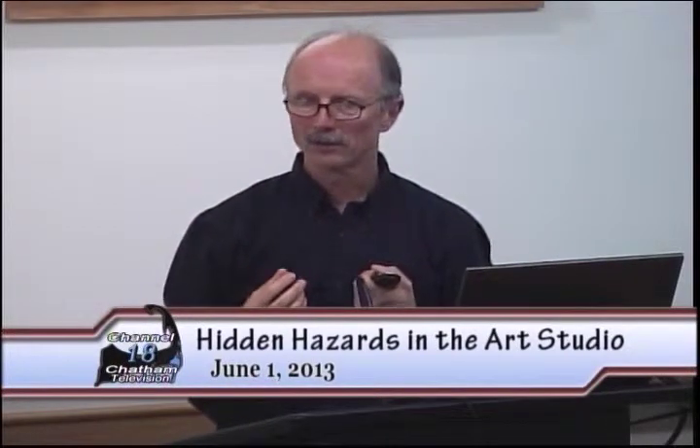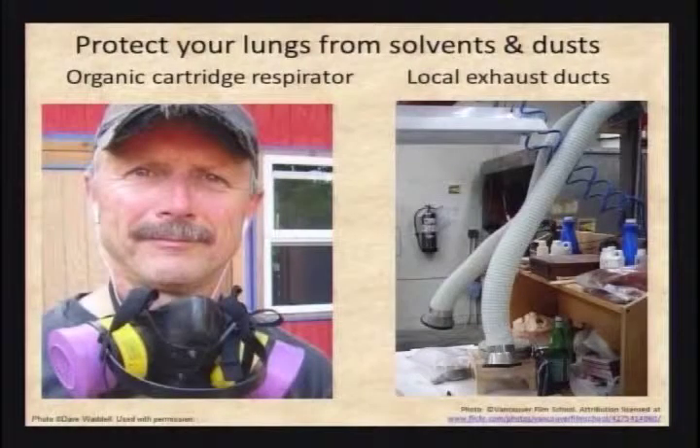You want to flare the bottom of the mask out a little bit — everybody just bends it straight but your nose flares out. That little gap at the bottom is where air will sneak around your mask rather than go through it. If you've got a good fit, when you breathe out you should feel a little pressurization, and when you breathe in it should feel like it's sticking. Some of those masks have an almost rubbery substance around the perimeter — those are really nice. Any hardware store will have them because that's what hardware store guys wear. They're cheap; when they start looking funky, put a new one on.